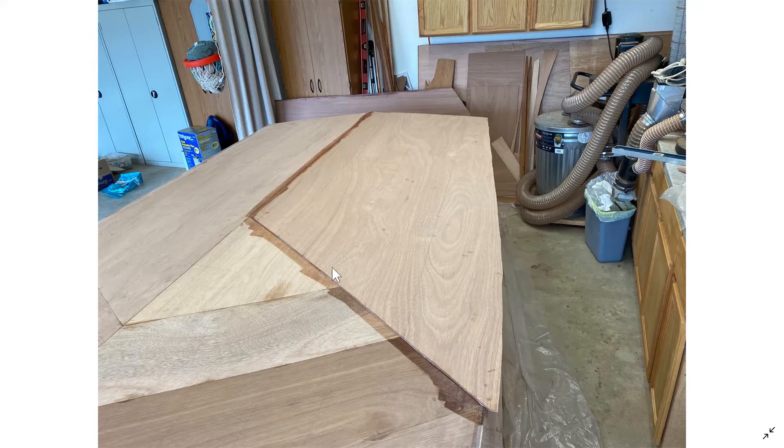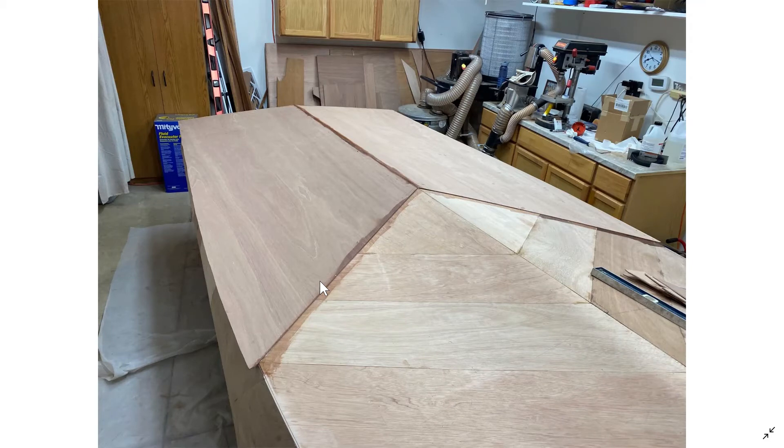My technique is to encapsulate the boat, then encapsulate the piece, flip it over on the other side, and then apply my thickened epoxy — which is the consistency of Elmer's glue — and put that on, then flip the board over right in place and use my composite nailer. This was a little scary doing pieces this big. That's why I use the silver tip epoxy, because it gives me a lot more working time before it starts hardening and gelling.